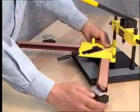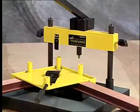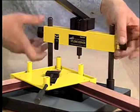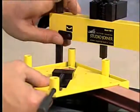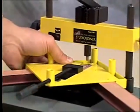Use the levelers to hold up the ends of the molding — simply spin them to the proper height. Adjust the beam height by lining up the depth gauge with the vise posts. Loosen the lever assembly knobs and adjust the beam so the depth gauge lightly touches the vise post, then tighten the knobs being sure not to over-tighten them.